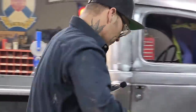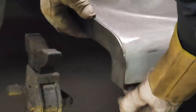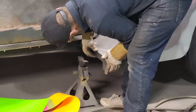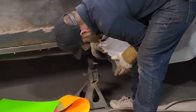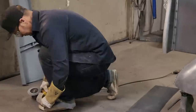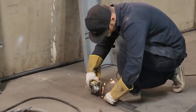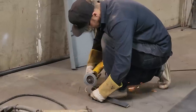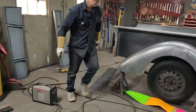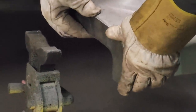Let's try it on the fender. Doesn't look bad. That roll could have a... A little more off the front, I think. It's got a little bit of an edge going on here, a little bit more than it needs. But you know what happens there? I leave it there, and then I grind it off as I apply that outside piece.